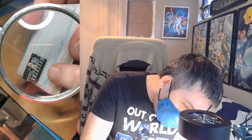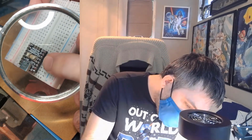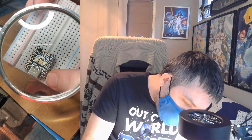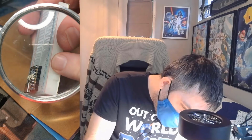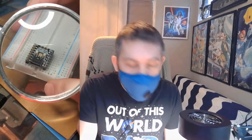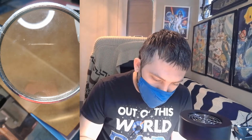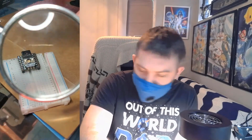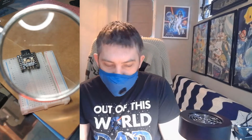So we do have a few Hershey's Kiss-shaped solders, which is what we're after. These sort of fat pyramid drops, that's again from it being too cool. And then at the end here, probably just me rushing a little bit. But this is my first one here that I did. So I got 40 pins of practice, and we just added a few more. So we're going to be turning the board over, doing the other side, and hopefully doing just as good, if not better, than we did before.